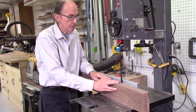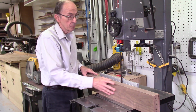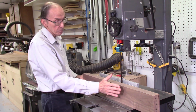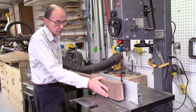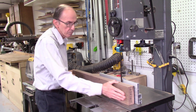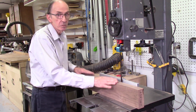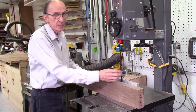you normally would see. But if you can push that straight through the bandsaw blade, you would not see those issues. But you do get those issues because in this case you have a big board, much bigger than a table. You can get movement this way, you get movement this way, hand pressure changing, body position changing. Any of those conditions will cause that board to move, and as soon as the board moves, you get blade drift issues.